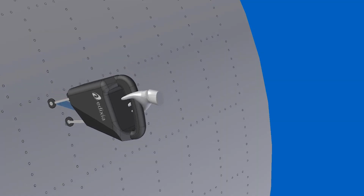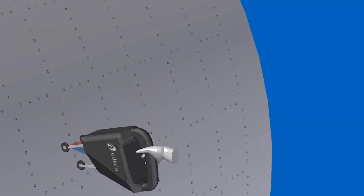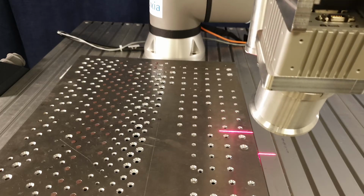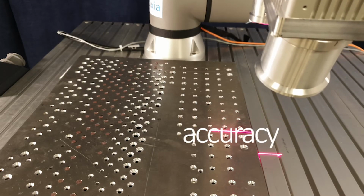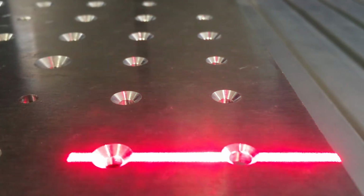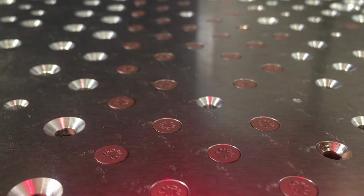The Rivet Inspect solution detects, measures and locates defects at each step of the riveting process, from drilling to riveting and milling. The control is done by artificial vision. It is contactless and is accurate to 1/100th of a millimeter. Any type of rivet can be inspected on any type of material. Rivet Inspect can also be integrated quickly and easily on production lines.